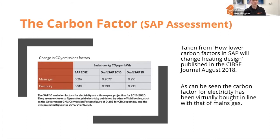And we hear people talking about hydrogen as a possibility, as a future fuel source. But really, hydrogen is going to take six times more renewable energy sources to generate the hydrogen than actually just putting the renewable electricity into the property in the first place. So it might not be the best outcome. It might be a good way of tying in current boiler systems or current piping systems, but for new builds, it's not going to be the be all and end all. So I think this might be worth thinking of long term as well.